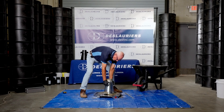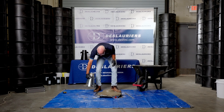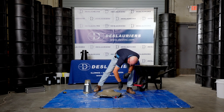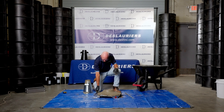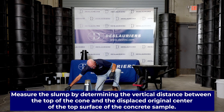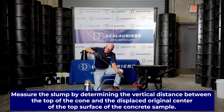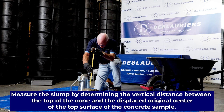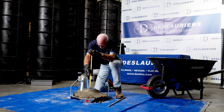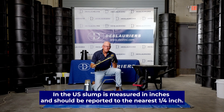1,001 — 1,002 — 1,003 — 1,004 — 1,005. We've got a little bit of concrete that's come off the edge here, but not very much — this is pretty wet, as I said. Now there are two ways to measure this. We can use the swing arm, raise it up, and measure down from there right to the middle of this mass of concrete. That is an eight and a half inch slump, which is what I predicted.